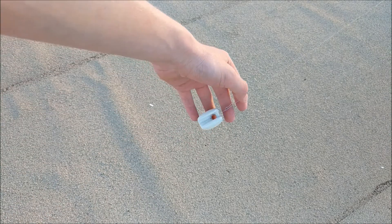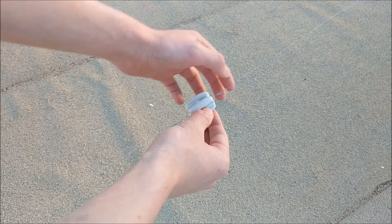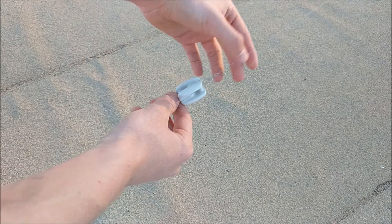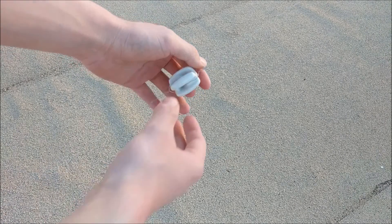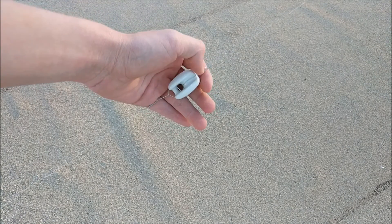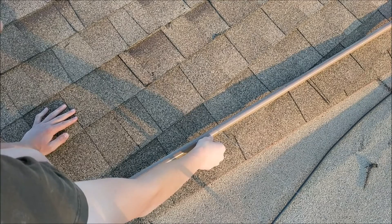This configuration of your coax cable hooking up to your antenna is a very good way because it does not require you to drill any holes in the stucco. At the end of the 8 feet of steel wire that's tied to the coax, there's another ceramic insulator to tie the antenna to another piece of steel wire that goes to a mounting place. We can't have these two pieces of steel wire touching because that would create a longer antenna which would make it not resonate as well at the frequency we're using. This ceramic insulator serves to isolate the two pieces of steel wire. This end of the steel wire is anchored to a piece of conduit that runs to the solar panels on my roof.